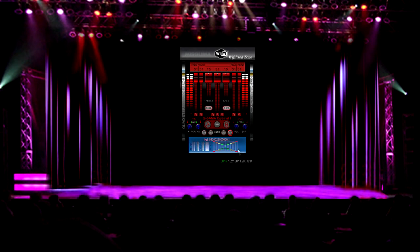Back to the green menu. We can switch from Wi-Fi to USB. The numbers show what virtual COM port the device is using. If the number is dimmed and it has a light green line under it, it means that the USB is not connected. By connecting the USB, the number will be highlighted.